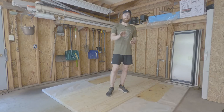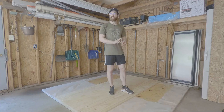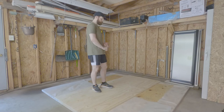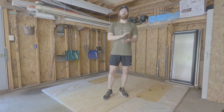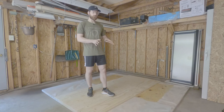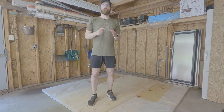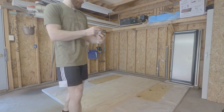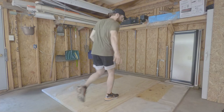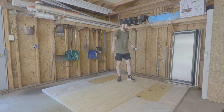So far we've used four lower grade quality plywood sheets, four foot by eight foot — four of those. We've got one high quality piece of plywood that is four foot by eight foot, a little bit of plastic wrap which you can find in the paint aisle if you have moisture in your garage to protect your plywood. Then you've got three four foot by six foot horse stall mats, and you want a box of one and five-eighths inch screws for the bottom two platforms. That's going to be on the perimeter of these bottom two boards and also down the middle where the seam is.